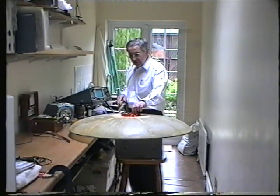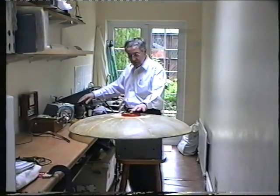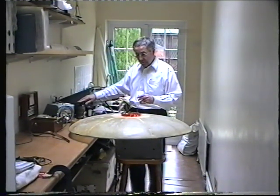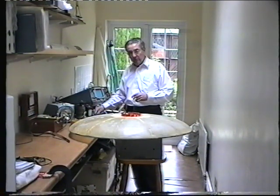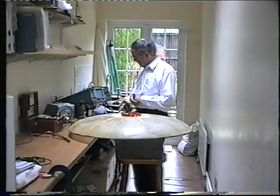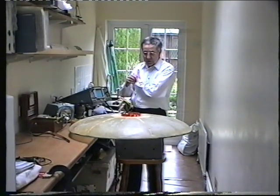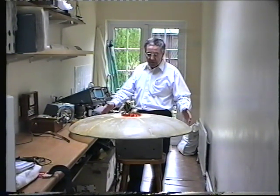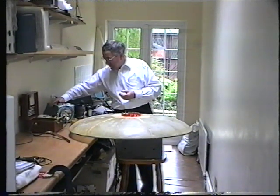The motor I've got here is a very small DC motor driven from a variac. The AC signal from the variac is rectified with a solid state bridge rectifier, and I've had some smoothing capacitance just to get the motor running reasonably smooth. At the same time, I can measure the power being consumed by the motor — volts and amps — so that sometime in the future when I start to model the effect of this airflow on a computer, I'll know what power was used to produce it.